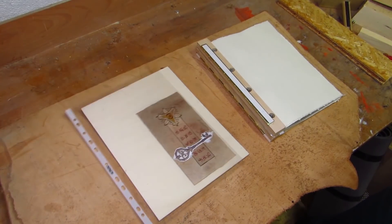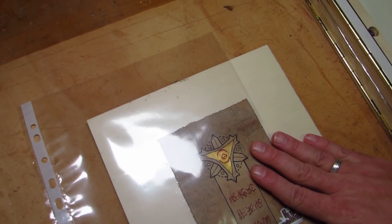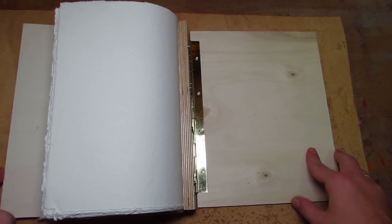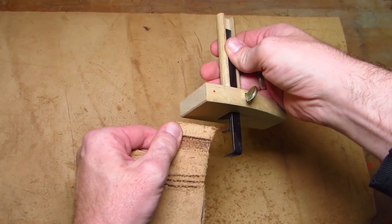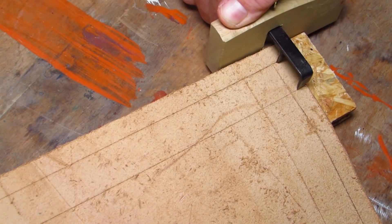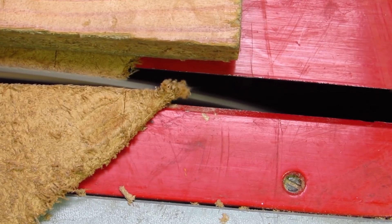On a side note, the Kickstarter included a key scroll, which I want to include in the front cover design. For that purpose, I measure the opening I need in the plywood so I can still get to it. Some thought and a test piece went into the measurements for the marking gauge, which I used to mark where I need to remove material to make the edges more bendable. I marked the three sides already cut, and just to say that I used them all, I do the final one on the table saw.